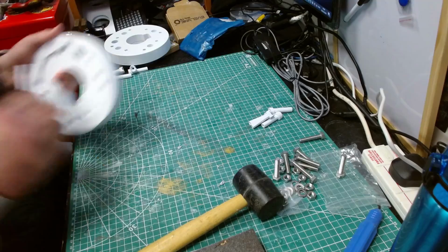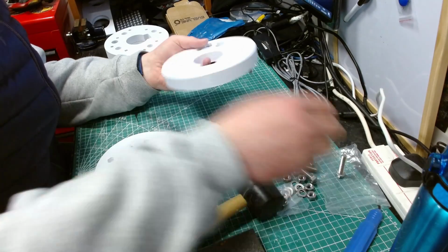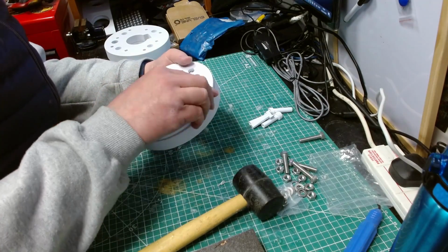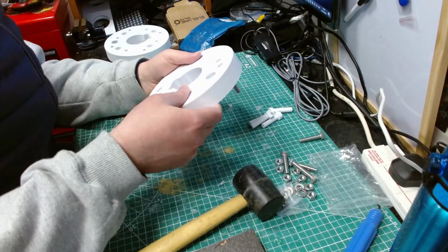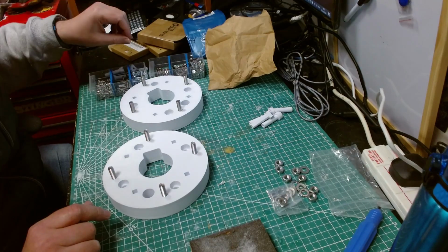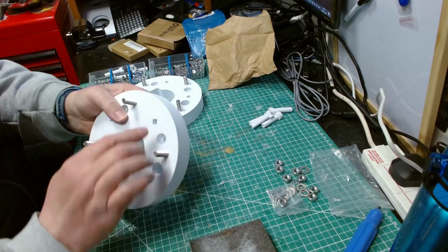Get the back of the hub off. Put these M8x40s back in. And then put that on. So that's now ready. We just need to put the screws through here. I'll just need to dig those out. Got the hex nuts in, hex bolts even, and I need M4x20 countersinks to go into here, and I need an M4 square nut on the other side there.